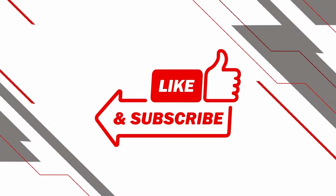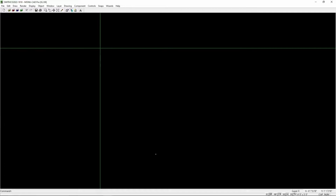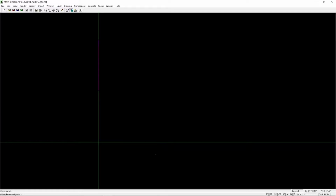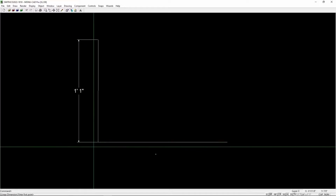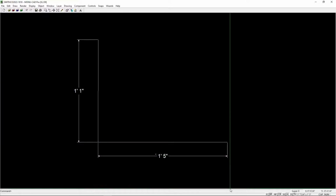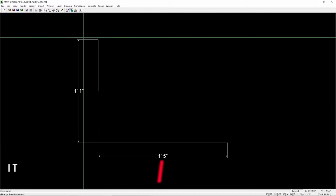Everybody! So today we're showing you how to trace an existing carving that's already on a die. We have a very nice straight on picture. If you watch the bottom left of the screen, it will show you the commands that I'm using today and what they are. So first thing I'm going to do is draw a half box of the size that I need that my carving will be.